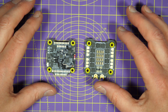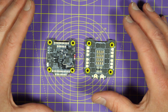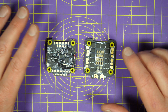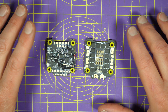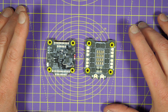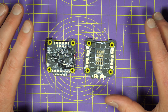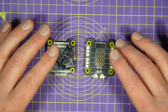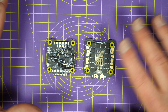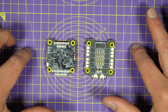Not just the usual flight controller parameters, but motor direction control on BL-Heli S and 32, a black box analyzer, and a firmware flasher. You connect to the app using Bluetooth to use the configurator, and connect using Wi-Fi to flash firmware and download the black box log files. So you can configure your newly built quad wirelessly, fine tune your PIDs, analyse your black box data and tweak other parameters in between flights — out in the field or on the bench — all with one app. And that's a world first.